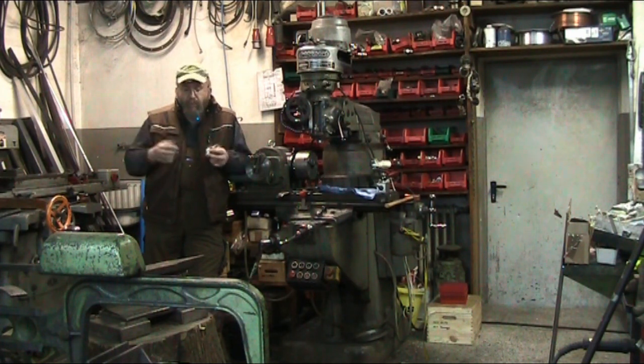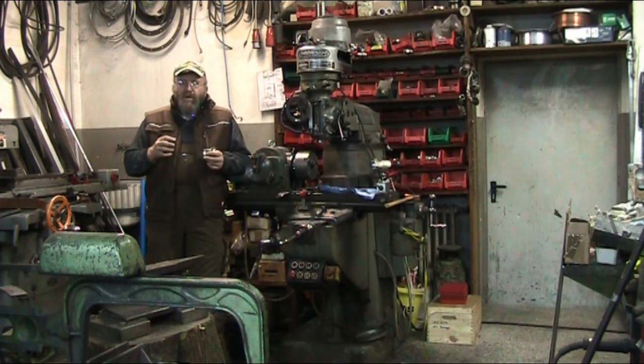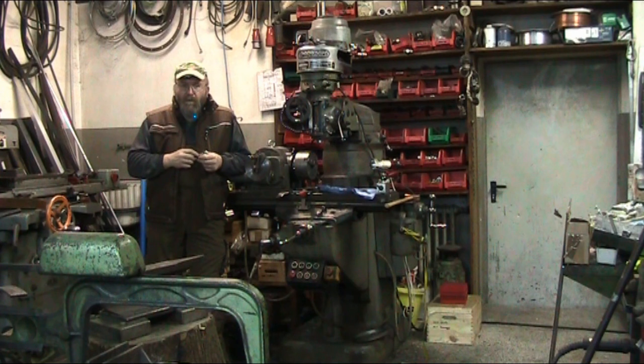It just pops right in two, because you have to exert so much force in order for it to hold, or as soon as you put a tool onto it and start cutting, that tool pressure is going to push against the workpiece and possibly split it and rip it out of the tailstock. So that's why this little guy here is critical in order to make it work. I've done it before without these little doohickeys, but let me tell you, it becomes a real adventure real fast and real dangerous.